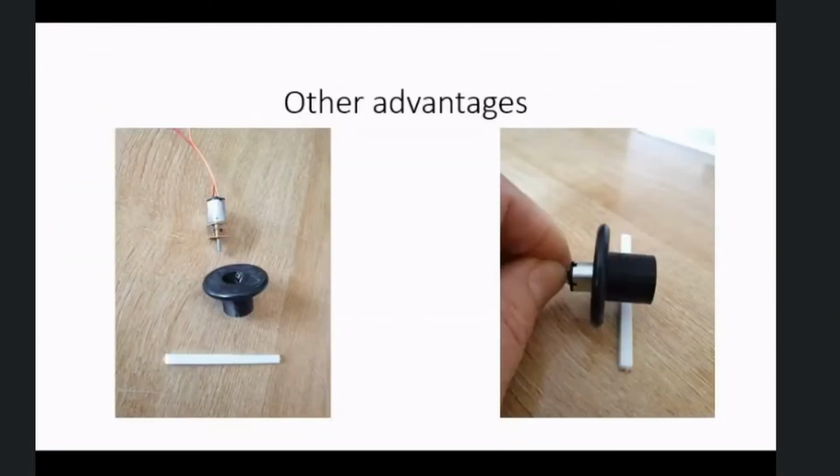Quick question. Did you think about actually looking down on the walls rather than from the side? Oh yes, this is what you would do. So you'd use a conventional line sensor, looking down on the walls. You've only got to raise it up by 3mm of what you're doing anyway with a line sensor. So it's straightforward stuff.